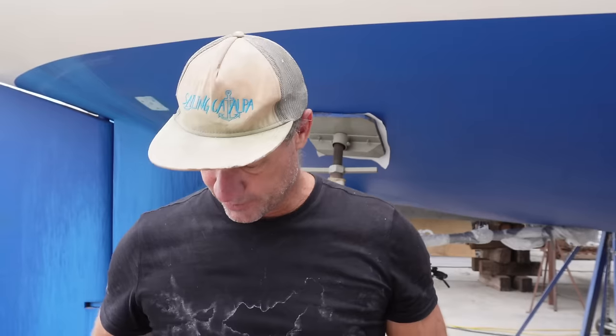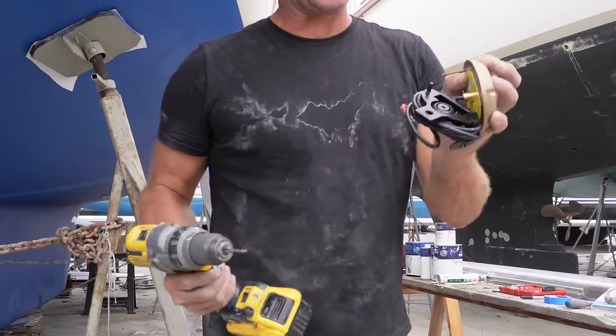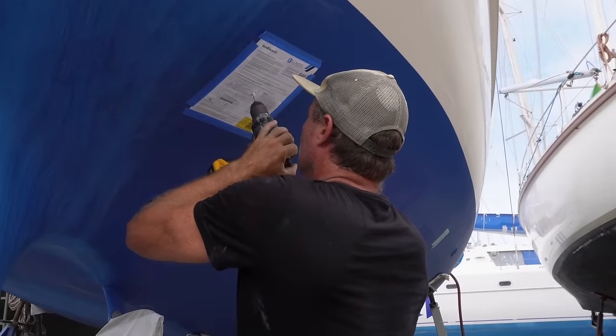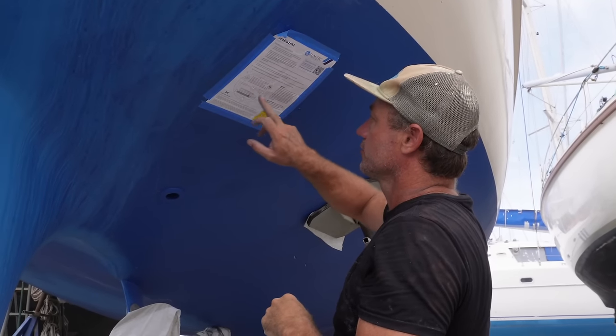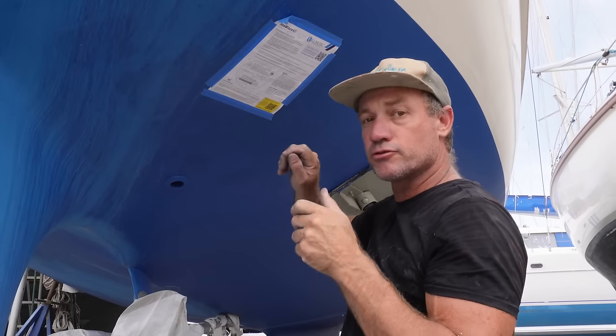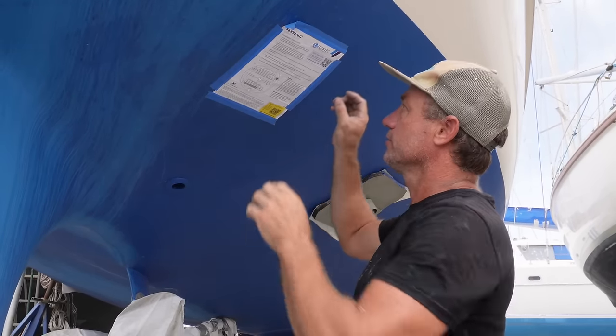If I don't mention it when I'm doing it, I'll tend to put just a little bit of blue tack in there and smear over it, then go over that with the Total Protect. So if I do need to access it later, I just pop the Total Protect off and the blue tack is soft and I can access it with a screwdriver. I sort of do that with fittings like that — cutlass bearings, if you've got a grub screw holding it in, put a bit of blue tack in there so when you come to switch out your cutlass bearing you can access the hex drive or whatever bit you've got. Sunday morning, let's crack into it. I'll set that up and put a little pilot hole in the middle here — that should be about the right size for the screws.